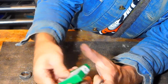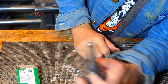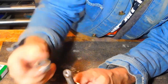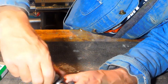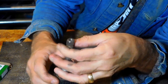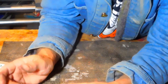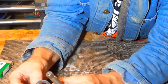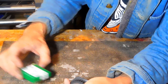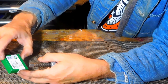You can still buy these bearings — I'll take a still shot of the box. I believe I bought them at MSC; if you Google the part number it'll come up. When I first bought the sander, I took it apart and put it back together, and finally found these. I soaked them in kerosene and put them back in, and it worked better — worked fine, except it was still a little stiff. So now we're putting in fresh bearings.